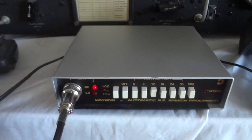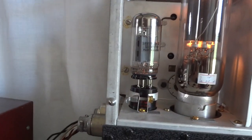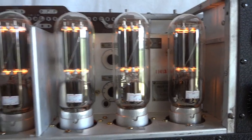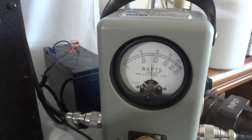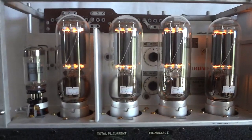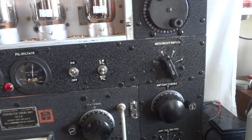Now turning on the compressor and the microphone. One, two, three, four, five — testing. Man, that works like a son of a bitch with a 6L6 triode — a pentode switched as a triode — as a microphone preamp, driving the push-pull amplifier tubes, which in turn modulate the transmitter. We are at good power here: 250-watt slug in the Bird, and we are at about 80 to 90 watts carrier. We did not need the VT25.